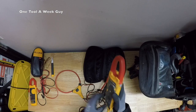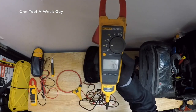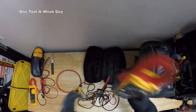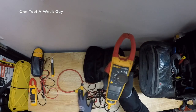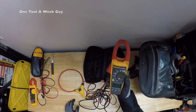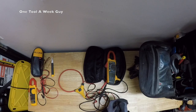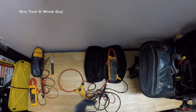The 376 also has a hold button and a backlight. The one thing it does not have is the temperature probe setting — that's on the 324. And conversely, the 324 does not have iFlex. If you need readings up to 1,000 volts or 2,500 amps, I'd definitely recommend the 376. You pay for what you get. Fluke is a great, trusted brand. That's going to conclude this episode of One Tool a Week — thanks for watching as we continue building our tool bag. Stay tuned for what we add next!